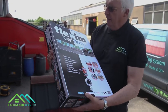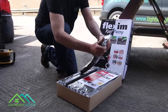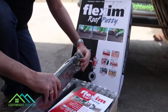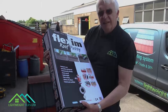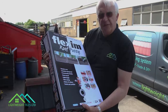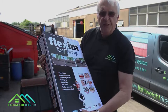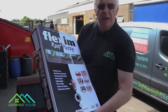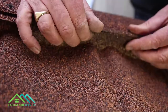Here we have a box of flexing roof putty. It's a material we found works really well as a gap filler to fill the gap between the bottom of the ridge tile and the surface of the tile that the ridge tile sits upon. It's completely waterproof, very soft, almost like plasticine, but it goes off very, very hard — like the rubber on your tire.